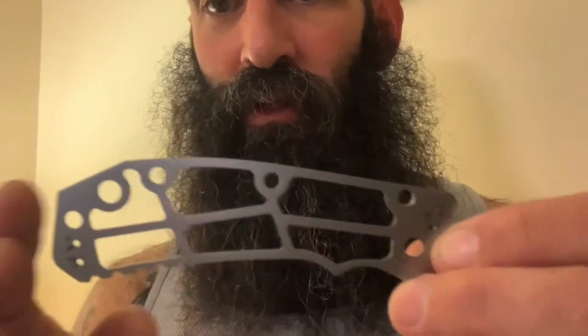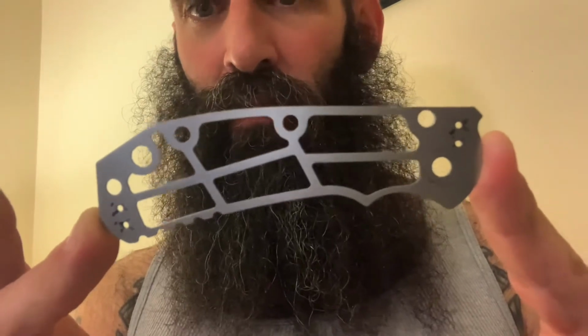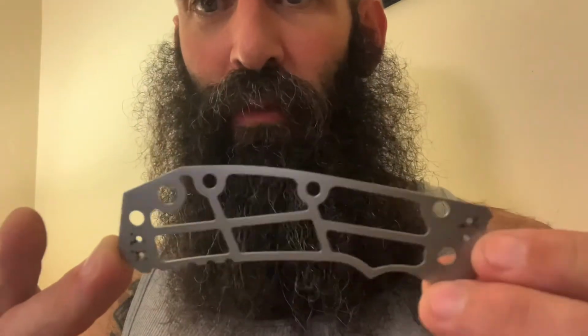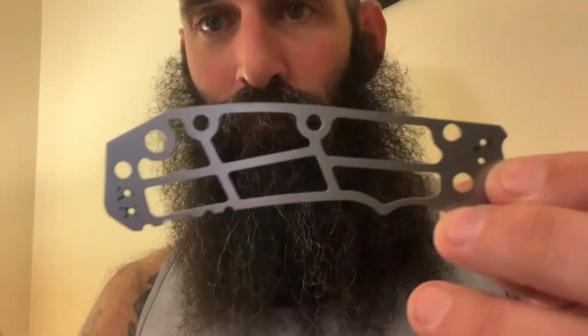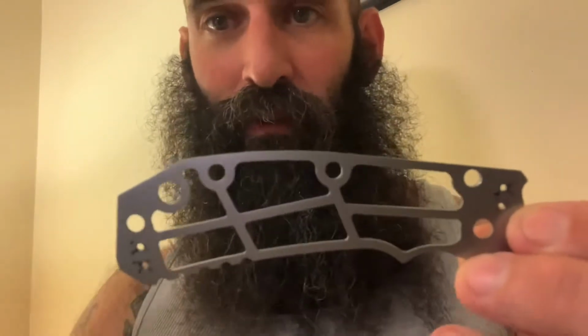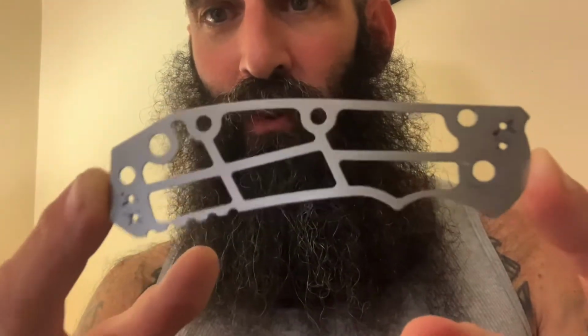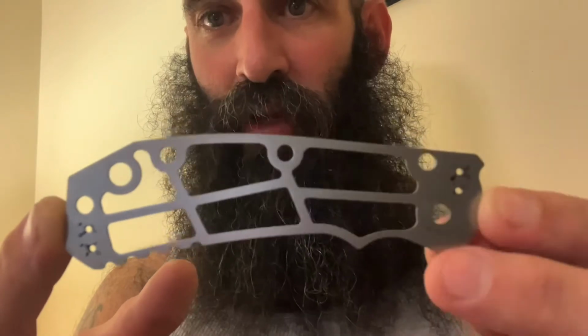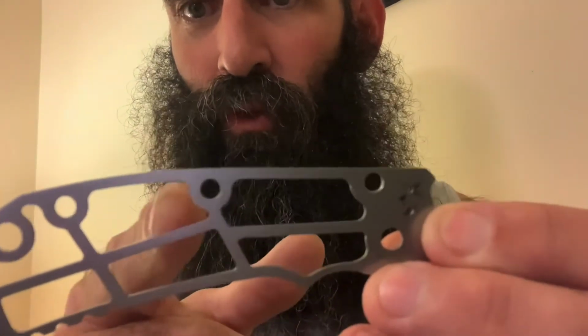So what I did was lay this on a CMM. If you guys don't know what a CMM is, it's a coordinate measuring machine, and I think that's basically what DTM Kyle does. He's a turd sniffer, or whatever y'all call him there, but basically people who try to find things wrong with parts, or inspect them, whatever you want to call it. They're probably the most hated person in the shop, aka the turd sniffers. Okay, there you go. So the turd sniffers will put the part like this on a CMM and generally check it. They have to check a couple different things: a profile, and then holes, hole size, hole positioning, all done on a coordinate measuring machine.